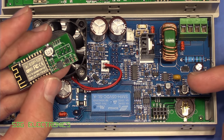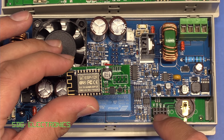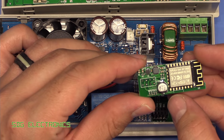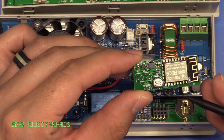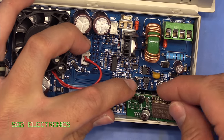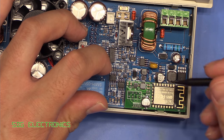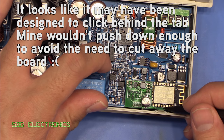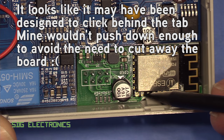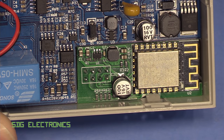This is the Wi-Fi enabled version, so it comes with a little module that plugs into an 8-pin connector. There's also a battery holder for the real-time clock. What is quite annoying is that there is a small square section on the module that needs cutting out for it to fit — if you try to fit it as-is there are too many parts in the way and it fouls the connector. I took some side cutters to the PCB and it fits now, but it's dangerously close to one of the traces. It would have been nice to have seen that milled out from the factory.